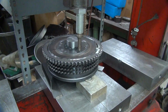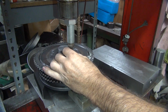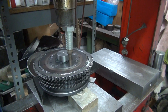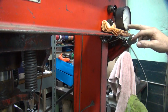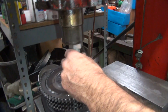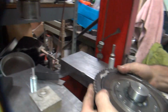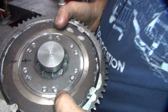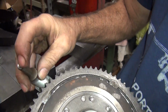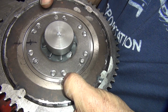So you just center it up over the rivet, and it's going to go sideways a little bit. Can't seem to stop it from doing that. Put 500 right over here, up to 500 or 5, which is 5 tons pressure. Put a little squeeze on it, and that dimples it in there. So see where it pushes on that. It's got a little bit of a radius head to it because this here has a little radius to it. So they're not in there 100% all the way across the whole area, but they're not moving anywhere. They're tight.